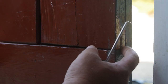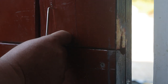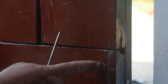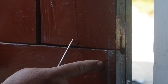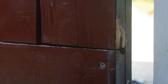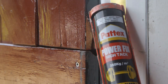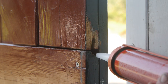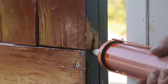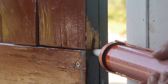I found another little rot spot over here, and I've got the feeling that the whole back side of this plank is a bit rotten. For now I'm going to leave it. I also installed some extra screws in this board to reinforce the door a bit. Let's fill up this hole with some Patex high power high-tech stuff - it's pretty thick, should do the trick. I'm thinking this rot comes from water that gets blown over the top of the door during winter. The door is facing west and we get a lot of wind from the west.